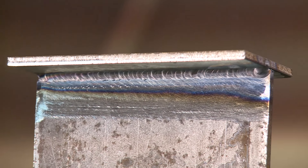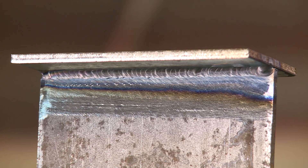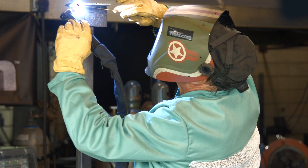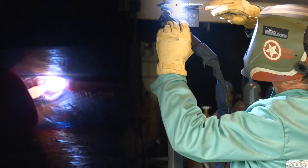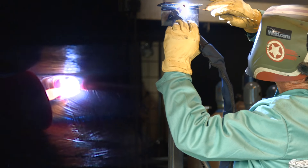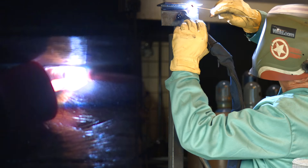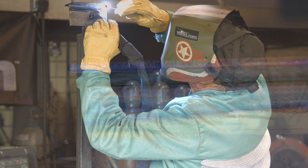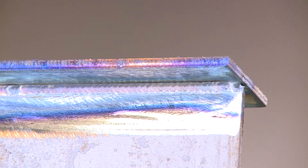There's the first part of that. I want to come in a little bit here so I've got enough room to rest the cup and show you another little technique. This leaves a little different profile of weld — kind of flows along nicely. When we get done with this, you might not be able to tell. If I turn this over, you probably wouldn't be able to tell what position it was welded in — overhead or just plain old horizontal on the table. Look at that.